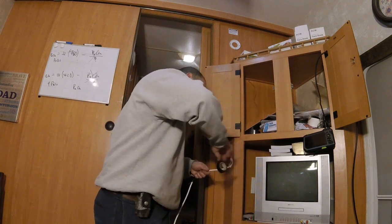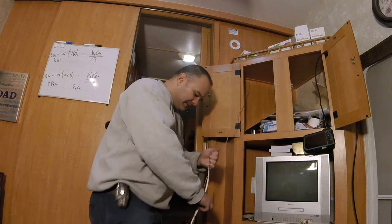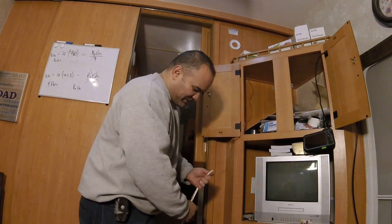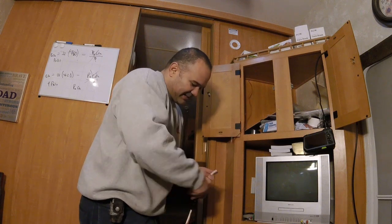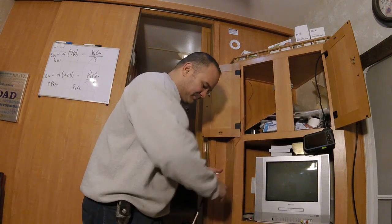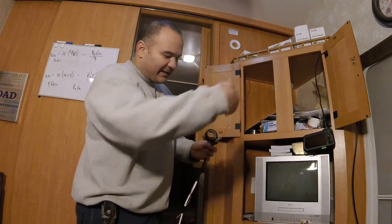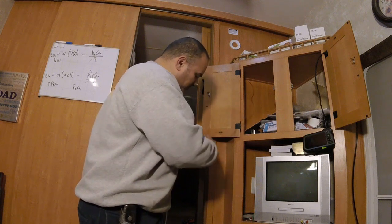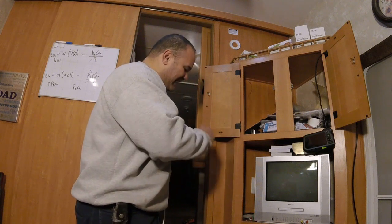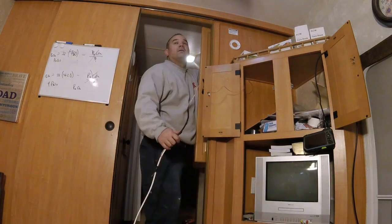So when you're taping it, all you really have to do is just kind of tape it tight so that you don't have a lot of slack around. You don't want too much tape at this point. Anything bulky, it's just another catching point. We don't want that. So I'm going to take this out. Okay. Let me put this off. Try to make it like a smooth transition from the string onto the wire. Everything that can snag will snag. So keep that in mind.